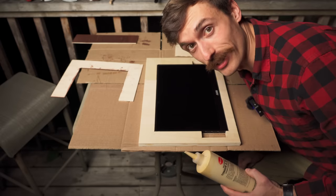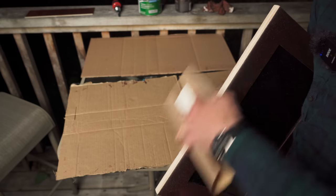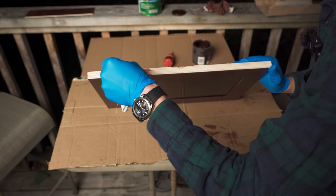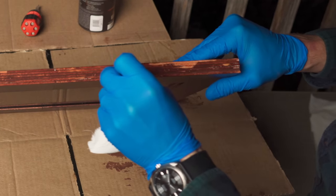Once all the faces are stained and varathaned, it's time to seal in the monitor. Add some foam tape to the back of the monitor and place it inside. Now take your wood glue and carefully apply it around the edge of the monitor — being careful not to get too close to either edge. Then place your front face pieces on top, carefully lining everything up. Wait until the glue becomes tacky and then once again weight it down with your plywood and heavy things. Once that's dry we're going to do another sand on the edges. The reason we didn't stain or varathane the edges before was so that we could sand the edges at the end once the front face panels were on to make sure the edges line up. Once you're happy with the edges you can repeat the same steps to stain and varathane the edges. As I began applying my stain to the edges I realized the big mistake I had made earlier during my initial sanding — I had some excess glue run off and I didn't sand all the way through it. Stain isn't going to soak into dry wood glue, which means I have light colored patches along the edges. I could have stopped and sanded the edges again, but I didn't, and I have a very good reason for that: I just didn't want to. And then I made another critical mistake — one that I can't fix, but I'll show you how I've covered it up on the finished product.